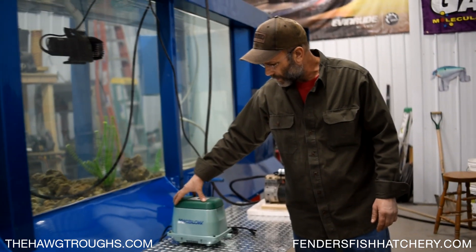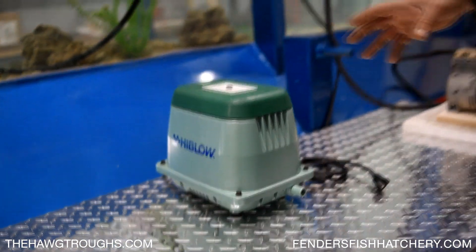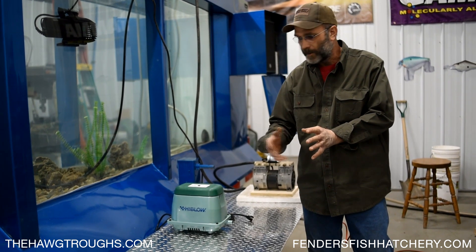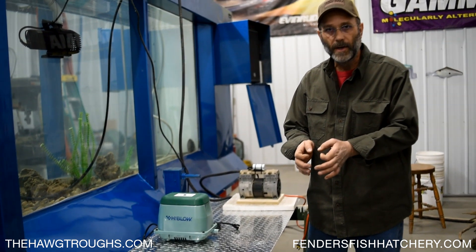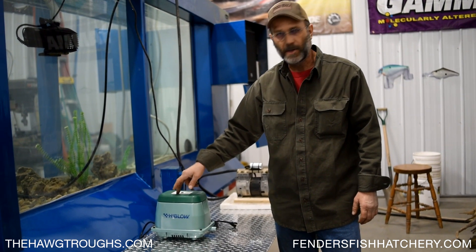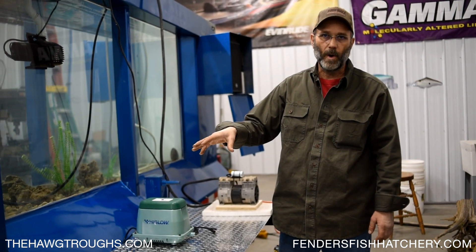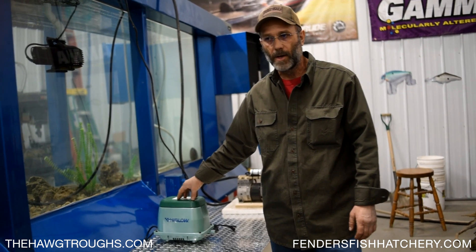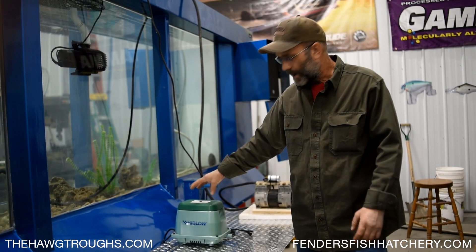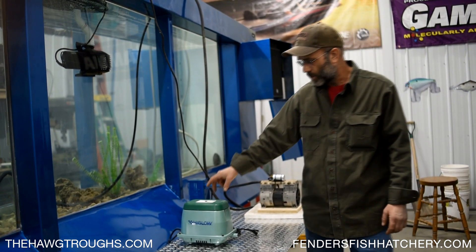Another type of system we've got here is from a company called Hyblow — a company I recently started dealing with. What I like about them is this is a diaphragm-type compressor. The advantage of a diaphragm compressor versus a piston type is fewer moving parts. You have a diaphragm moved back and forth electronically with a little plate, and it has a couple of check valves. This company has put them in freezers and frozen them, then turned them on to make sure they operate in real cold temperatures. I like this diaphragm pump because it'll work in extreme cold temperatures and also in deeper water. I still don't want the stone deeper than about eight to ten feet, but these will work at that depth. Cheaper diaphragm pumps were built for shallow water — if you put them below about six feet, the diaphragm would tear. These have proven they work in deep water and cold environments.